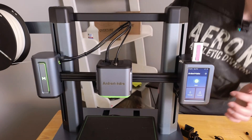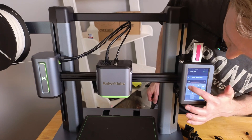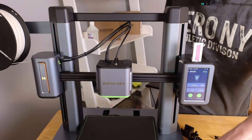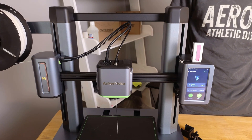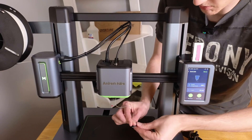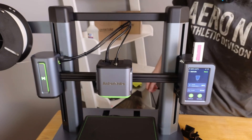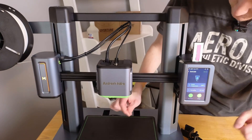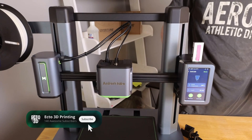That's all the way in. Let's power it on. Let's go into Control, Extrude — go to 180 and Extrude. Let that heat up and here we go. There's our extrusion. Wow, that is a big glob of stuff right there — that was what came out of the nozzle at the beginning. But it's fixed now. We got the blockage out and we have white filament coming out now. Let's extrude one more time. There we go — there's our filament.